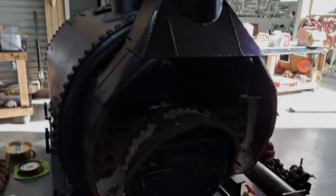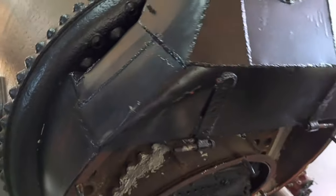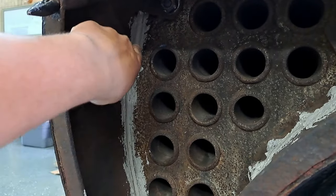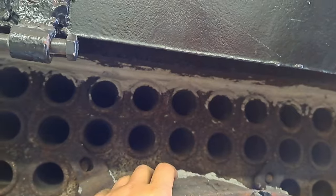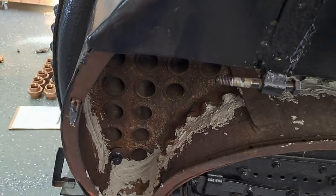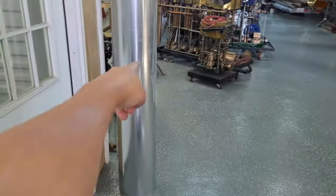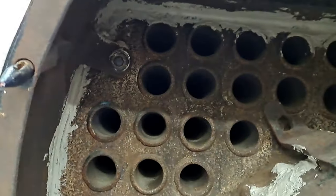Okay. We have here, Alex and I got the smoke box on. It's old and really a new one should be built. Anyway, there was a lot of corrosion and pretty much rot all along the inside of this thing. So what Alex and I did was get our hands dirty, and we put this sealing cement in here because if you don't seal this, any outside air is just gonna come in. It's not gonna create a draft up the chimney. This is where the chimney ends, at least part of the smoke box. There's the extension over there, so we actually have a sufficient draft, but we have to seal this up to create a draft. And yeah, it's messy, but we're going to clean all of this up.